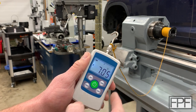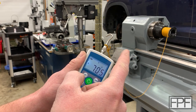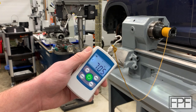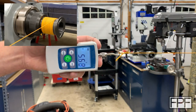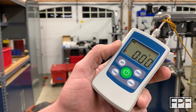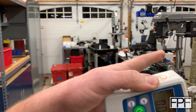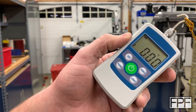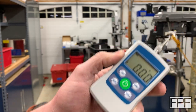I think I saw about five and a half there steady as I was pulling it, so we're probably too tight. I won't know for sure until I actually warm up those spindle bearings first, but just for the sake of testing, let's loosen that up a bit and see if we can get down to the range that Boxford calls for. I think I've seen an average of about 0.6 there, so now I've gone too far in the other direction — but you guys get the idea. So when I do finally get the bearings run in, I'm going to be looking for a consistent 1 to 1.2 pounds of pull on here.